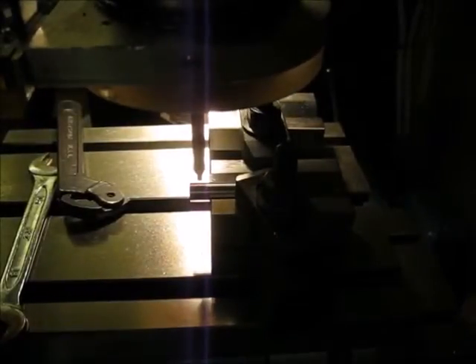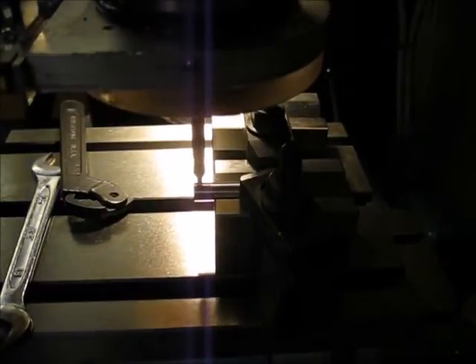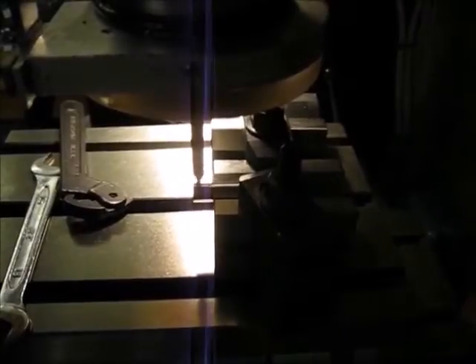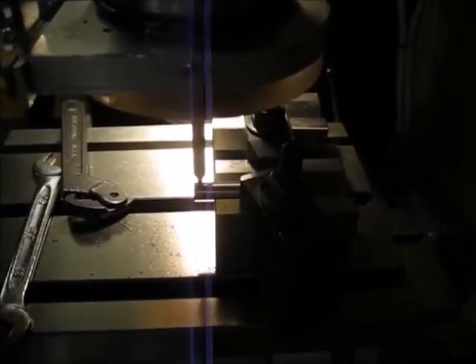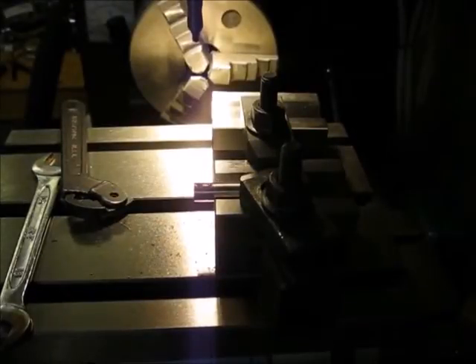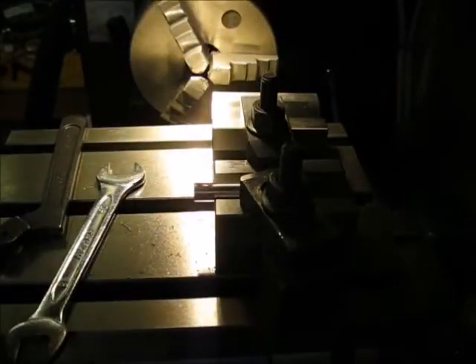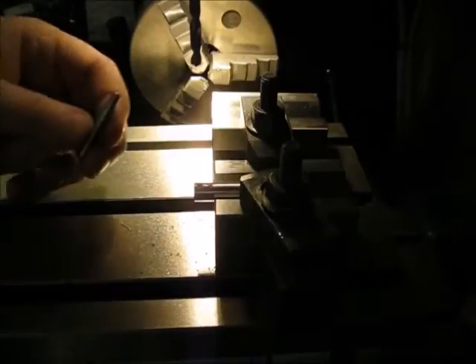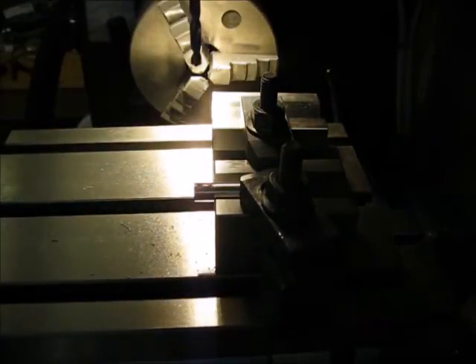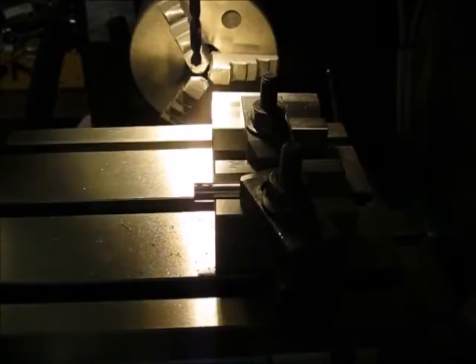This time I hopefully won't interfere with my clamps. I'm just going to eyeball it. My handle measures .183 and I want to press fit it into the body. I'm using a .182 drill and then a set of over/under reamers — one hole slightly under, one hole slightly over — and then I'll use my press to press it in. Or at least that is the plan.